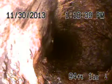All cast iron. Right here could be a clean-out. I did locate that on the side of the hill, but it's probably at six and a half feet deep. I don't know if that clean-out is extended up or if it's buried at six and a half feet deep, but I did mark it out there.